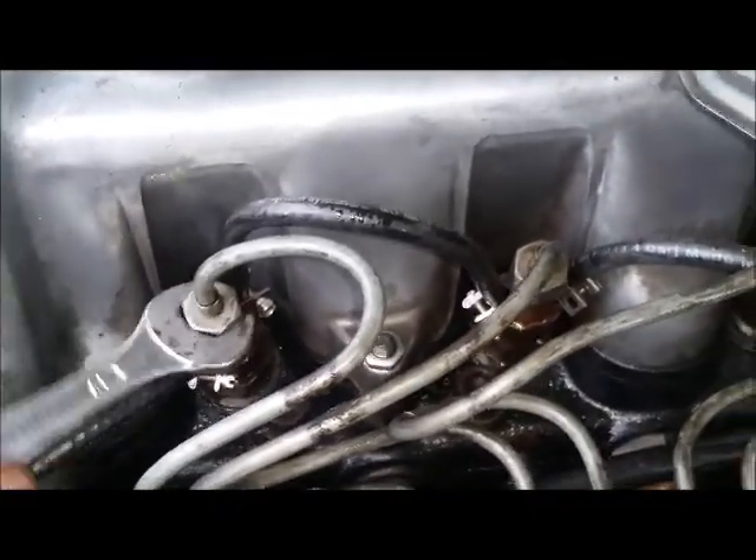There might be a whole lot of air bubbles in your lines if you've run dry, so instead of wasting your battery, we'll crack these injector line fittings open just the tiniest little bit - about a quarter turn. Do one, then switch hands - the two end ones are easiest to access. Loosen that up just a little bit, then number three, and then cylinder number two as well. Not much - just about a quarter turn, you just need to crack them.